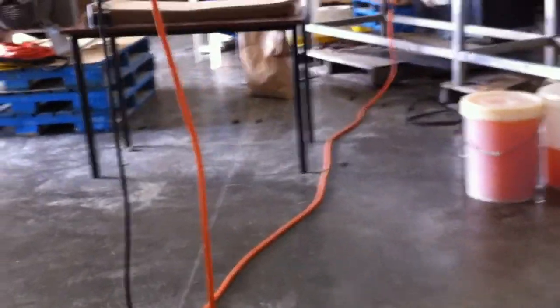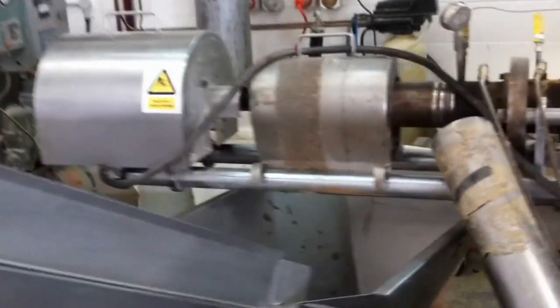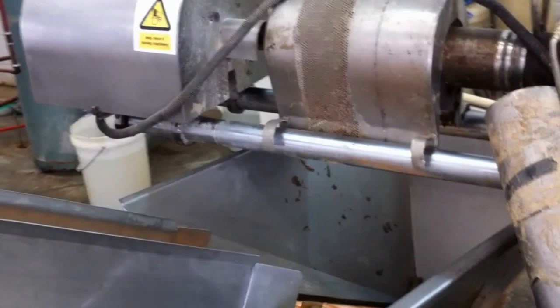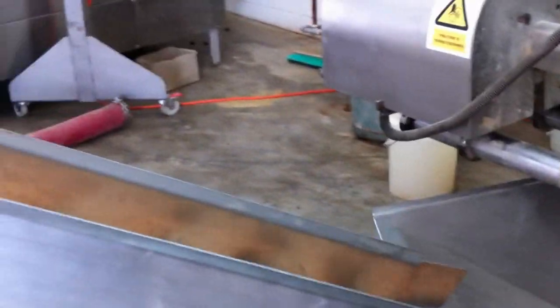And this one's for you, Richard — just come over here a second. You can see that PSI gauge is down pretty low, it's hardly registering at all — it's only about 50 psi. The reason for that is it's such a huge die, it's pretty hard on a small extruder like this to develop pressure. Now in a larger machine, obviously you can get up to a reasonable pressure and enable the coating to be applied at a much higher level if you can have an expanded product.